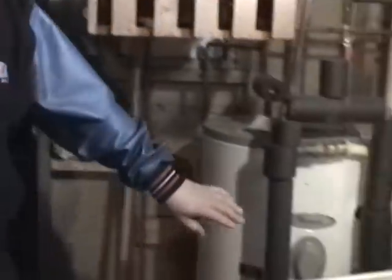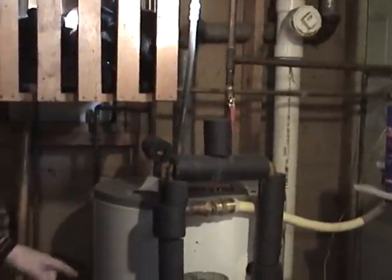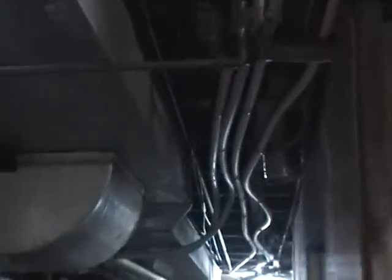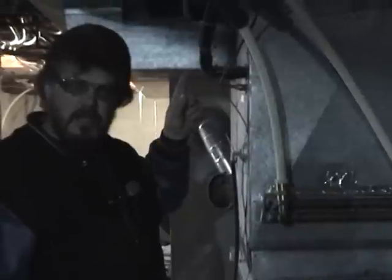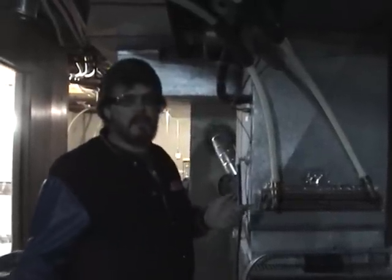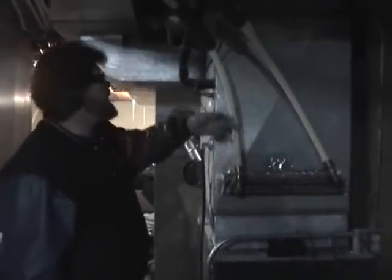It comes over here and grabs what I call a side arm on the side of the water heater, so we're heating the water — coming in on the bottom and going right out again. Basically you just have a percolator effect going on in this water heater; that's how you're heating the water up. One line heads up on the top, comes down, and heads into the coil in the top of my furnace right here. The water is always running 24/7. When the house says it needs a little heat, it turns on this blower and we push it through — I've got heat radiating out up there at 110 degrees right now. Then it comes down here and we send it back to the wood burner.